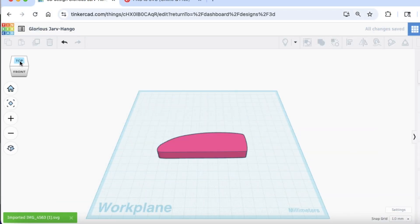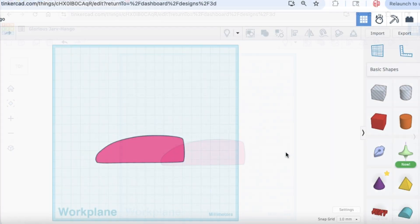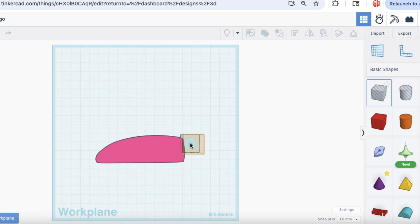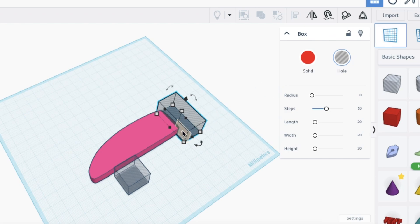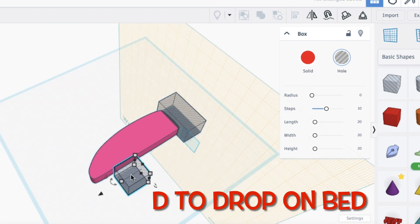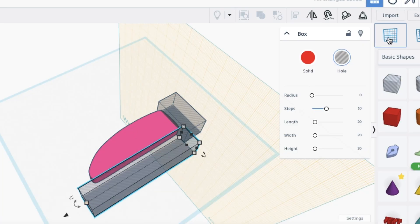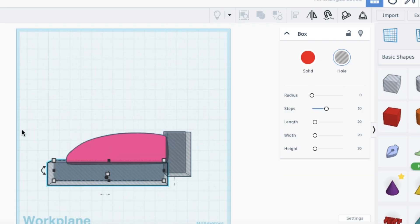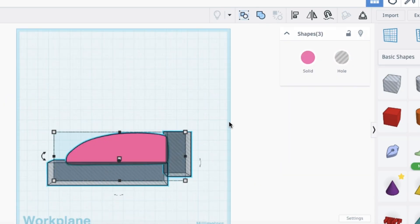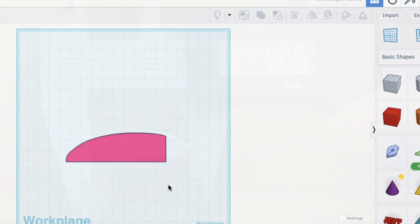Here's how it came out — pretty clean. It got rid of a lot of the junk and I didn't have to do anything. But I did want a flat side where the door touches and also where it's going against the frame. So I brought in a box that's a hole and lined it up to the edge to basically cut the edge off. Then I put the plane on that, brought another hole box, and rested it against that, bumping it up until it took the bottom off. Now I'm going to have a perfectly 90-degree edge on this molding. I grouped that together and now I had a pretty good start.